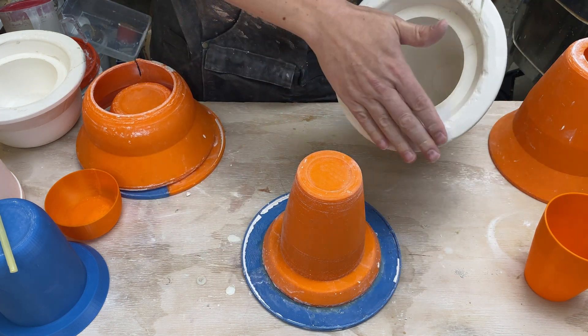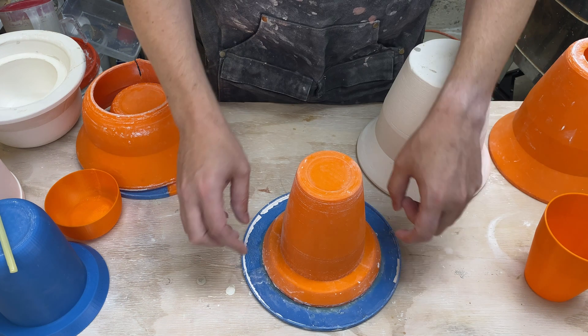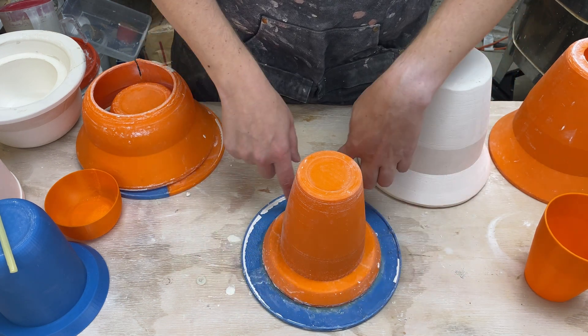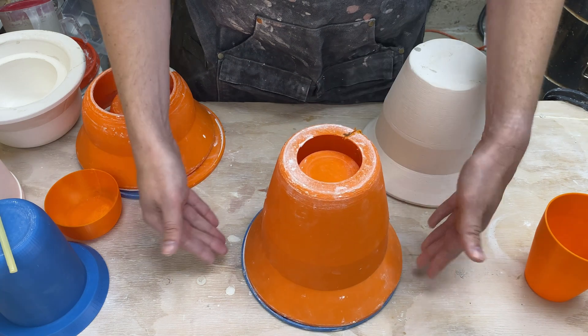It could be that the wax wasn't applied just right, or the gap wasn't quite big enough for the wax. This little lip and the attachment point may need to be a little bit taller. I had designed it so I could flow wax down the outside, but on the inside that's impossible — it's really hard to get up and around inside this lip. I wound up flowing the wax around this side, which worked okay but did mess up the top of the mold. I want to rethink the geometry so I can attach it from this side, and the outer piece from the outside.